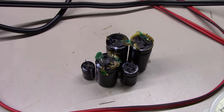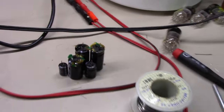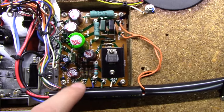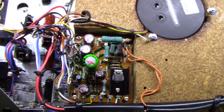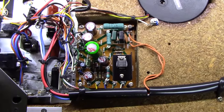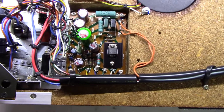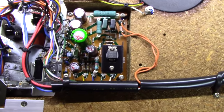There are all the capacitors that came out of it, and you can see the one that was leaking. The new ones are installed and you can see my little red scribble marks on top of them. That also helps later — if a customer brings a unit back six months or a year or three years later, I can always tell my own work. And I found one more little hidden capacitor down here that I need to get.